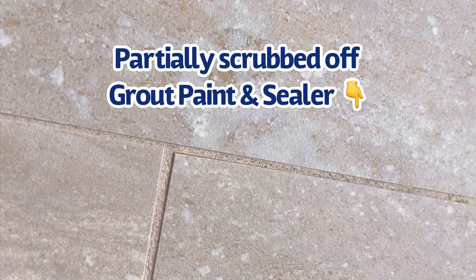Now let's talk about the one big shocking problem I found in this video that I haven't mentioned yet. Here's a close look at my grout lines after cleaning with that drill brush — that uneven coloring is the grout paint I used a couple of years ago being scrubbed away by the drill brush. So if you use a grout paint or even just a normal grout sealer on your grout, that drill brush is so strong it's going to start breaking down and removing that sealer or paint. I recommend not ever using a drill brush on your grout lines, unless you're planning to apply grout sealer right after, because you want that sealer on your grout to put a barrier against future stains.